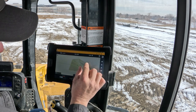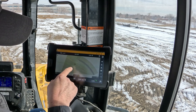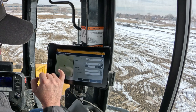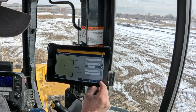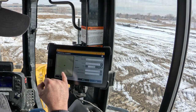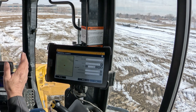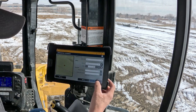What I'm going to show you now is a design where we've got the slope over to our left side and lines down here. Let's say we were cutting a pad — any of these lines right here can act as lines to follow. I can go into my horizontal, select that line, and leave it all at zero. Right now there's this pass shift overlap distance and overlap percentage. I want to make my first pass right down the line, then show you how to clean up that windrow by offsetting just a couple feet over.